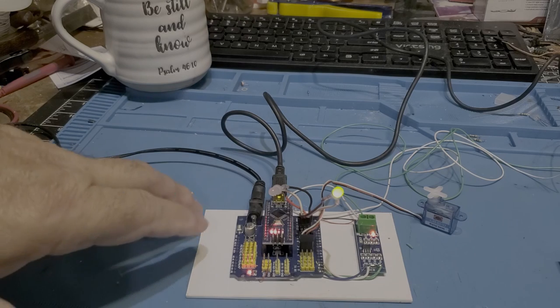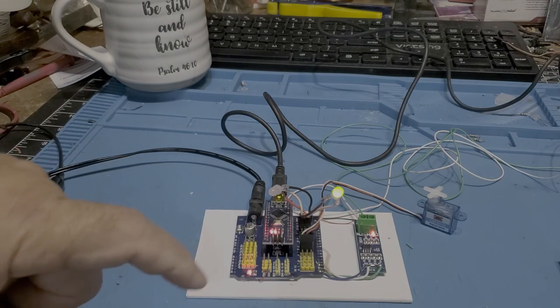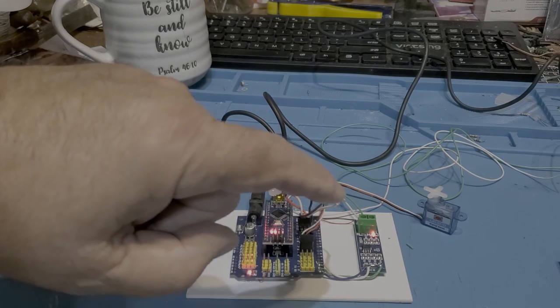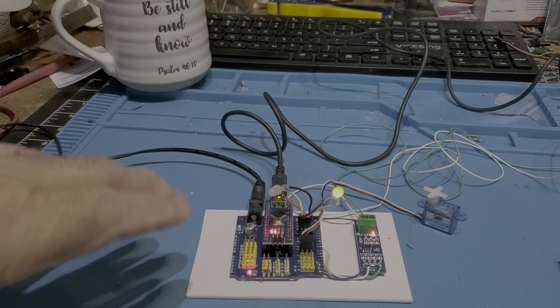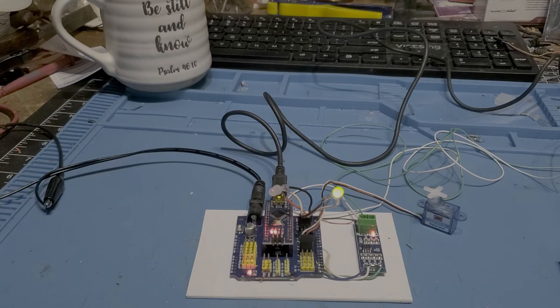But what I have here is my standard prototyping shield with an Arduino Nano on it. I have a pair of bipolar LEDs hooked up to two outputs and a servo hooked up to another output. I additionally have provisions for four switch inputs that using JMRI will toggle. We showed you how to do the inputs on the last video, so I won't go over that other than to give you the assignments when we go through the code.